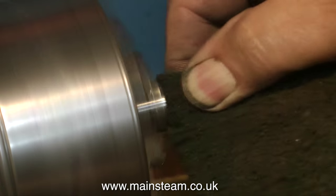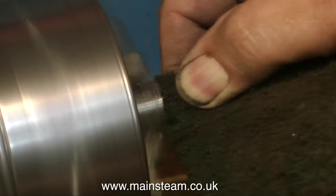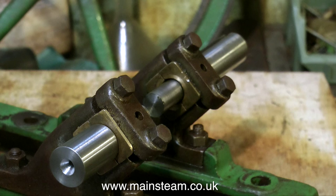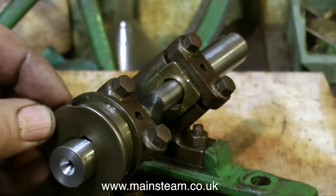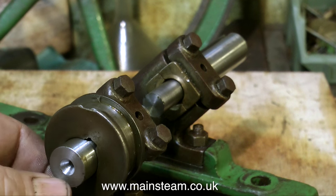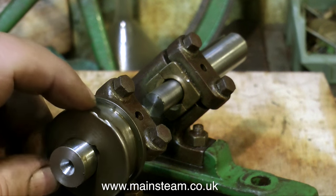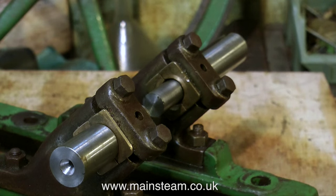When I was taking the final cut with the lathe tool, I took into consideration the fact that I would be removing a very tiny amount with some emery cloth and some Scotch-Brite before I got a good bearing surface on the part. Here I'm trying the parts on the engine, just to illustrate where they go. It's very important that the turned parts are exactly half an inch in diameter. More in the next episode — thanks for watching, and I hope you found it useful.